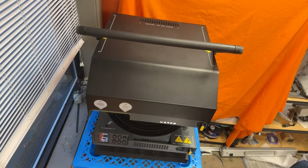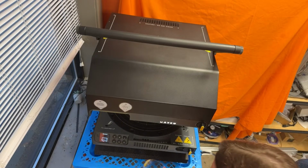You can get a larger pressure differential quicker between the front and back of the sheet, so you get deeper draws and more compact and less powerful pumps. That makes sense. You can probably get a lot of the same stuff with vacuum forming, but this probably allows a more compact machine.